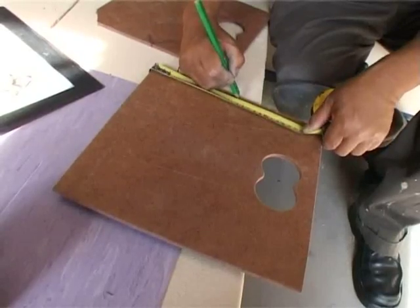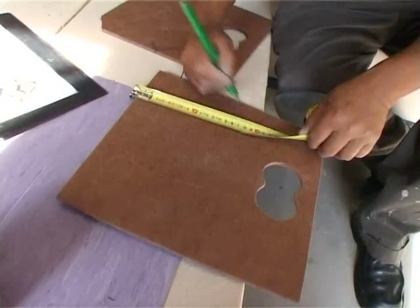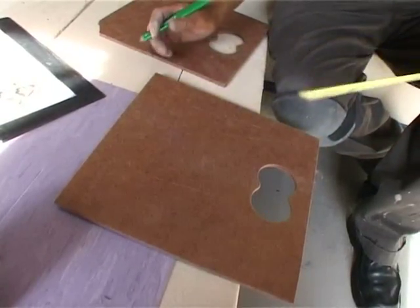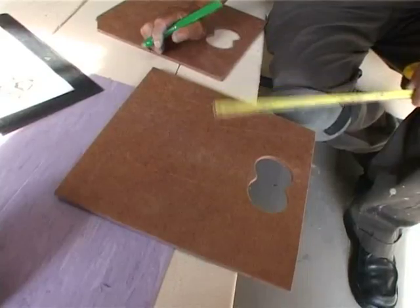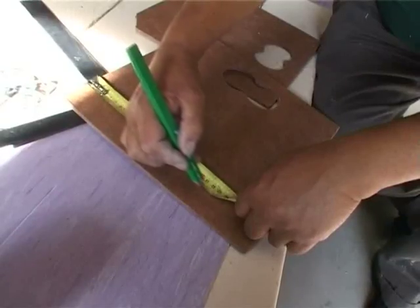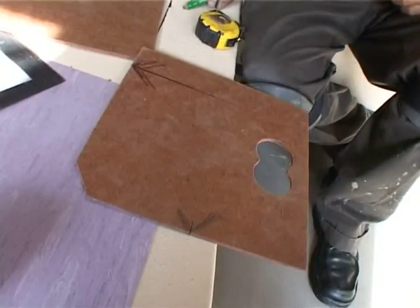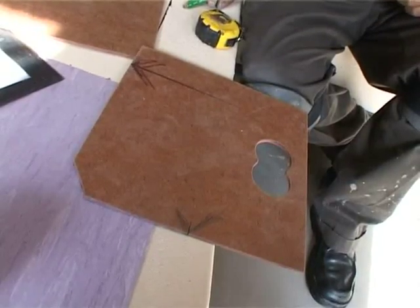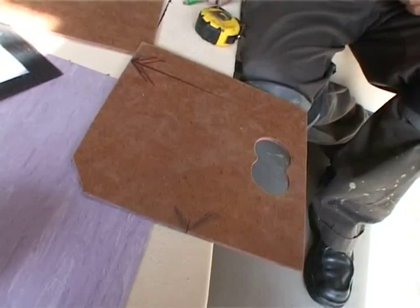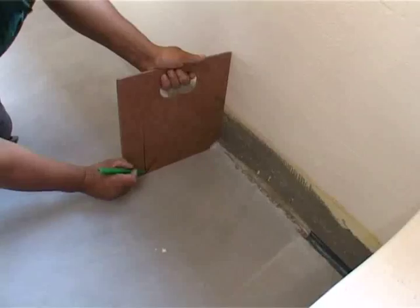Depending on the site conditions, you would install either the flooring or the coving first, but whichever, using a board gauge as indicated on the video clip. It is more accurate to mark both the floor and the wall from the gauge, which will be consistent throughout the installation. You will note on the gauge that the corner fitting into the cove where the wall and floor meet has been cut away at 45 degrees to allow for either the cove former or any minor variation or contamination that might occur in the corner.